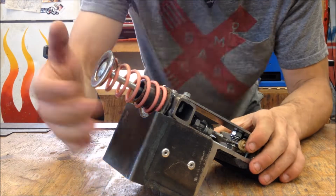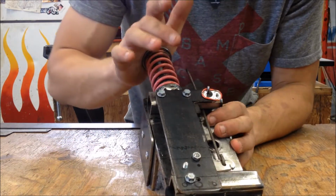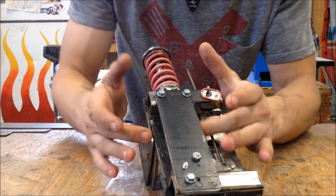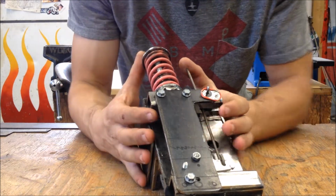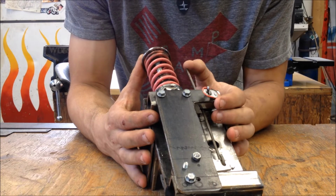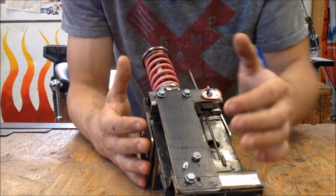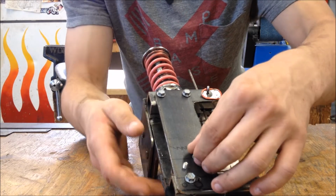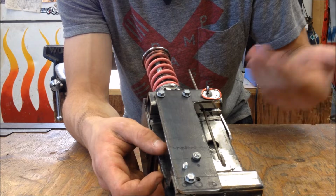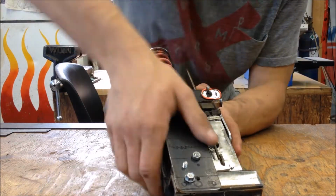The mechanism I made myself. Essentially, when this is cocked down, this little rod juts out and it's attached to the trigger over here, which holds the back of the bolt, which runs to the center of the spring. And then when you punch the object you're punching, since this sticks out farther, it'll hit this first and push the trigger. As it pushes the trigger, it releases the spring, and then the spring mechanism activates and adds 2 times the force of a normal punch to your punch.